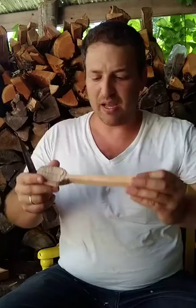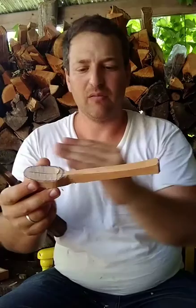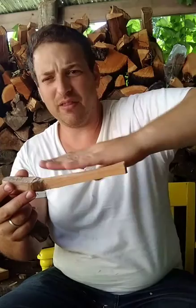Whether I leave this flat or bring it down and then have it come up is a combination of what I'm feeling in the moment and what the wood is willing to do. How far down I can dive into the grain without running into opposing grain has a lot to do with how steeply I angled this part of the spoon into the log. The steeper I angle it in, the more wiggle room I have to do big dips without running into grain going the opposite direction.